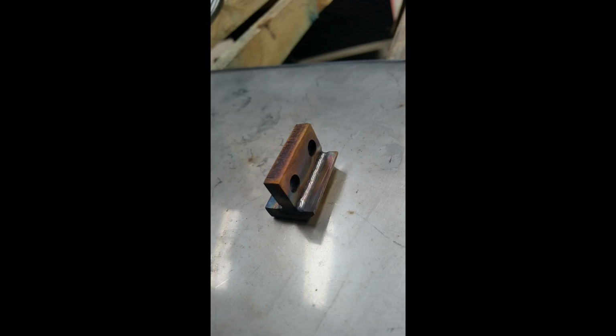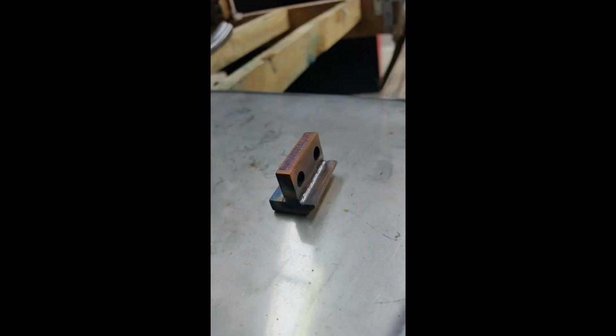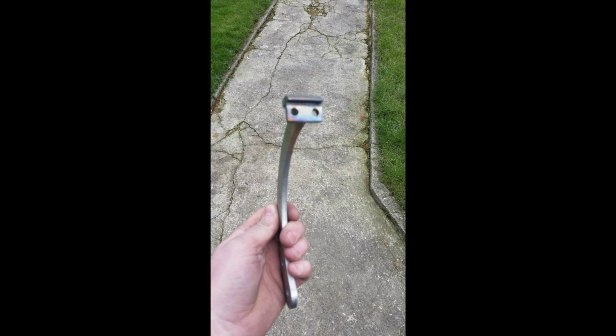This is the top piece of the arm that holds the electrode, the top electrode in the brass block. It is welded on with TIG, the TIG welder. You'll see the next photo here. So this is it welded on. This arm then was polished into a mirror finish, sanded, a few different stages.